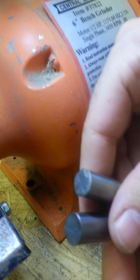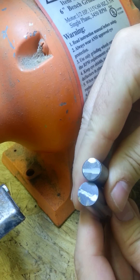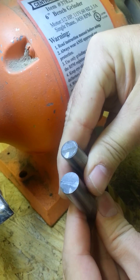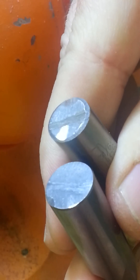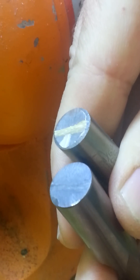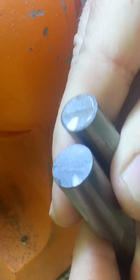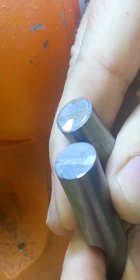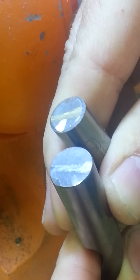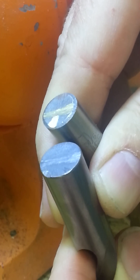Let's look at the difference between these two. On the high speed side, you can see that there's a ridge. On the carbide bit, I don't see any ridge — see how there's a difference and it's shiny? That's the steel. There is steel in the carbide bit, but it has a high percentage of carbon or carbide, so it's not shiny and there's very little ridge.